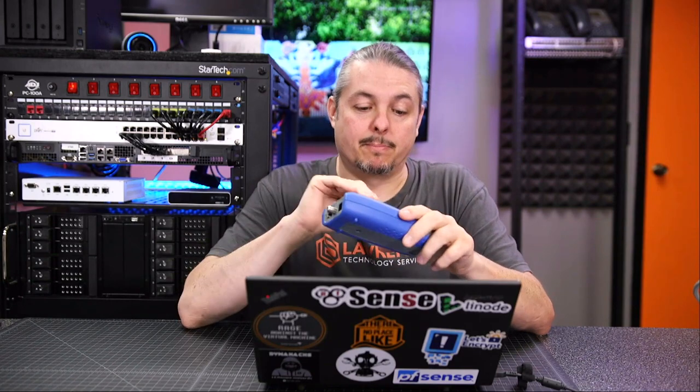I don't have a 90-watt PoE system to test with, but it can load-test up to that level. It will eventually cause the device to get warm, but don't worry — it has safety protection. I tried testing on this 30-watt system quite a few times and was unable to overload it. It won't damage the unit at all — it just lets you know it's hit a thermal limit and blinks on the screen. Wait for it to cool down. Doing 30 watts never even got warm at all. Safety protection is built in because when you're drawing 90 watts, you have to dissipate it in the form of heat.